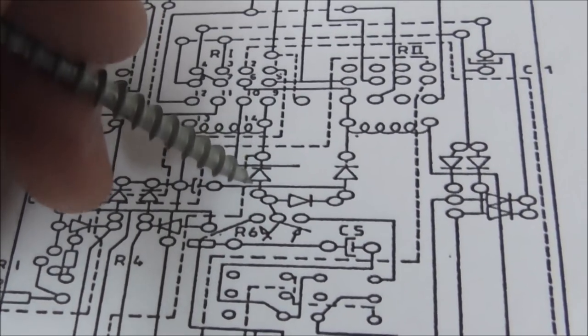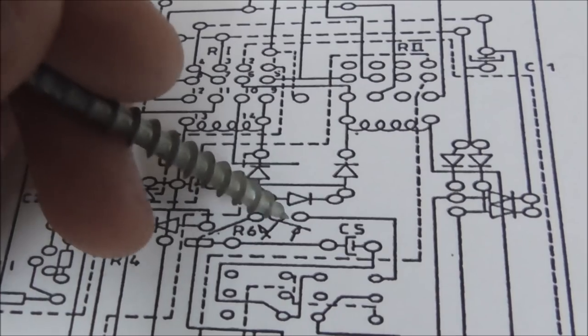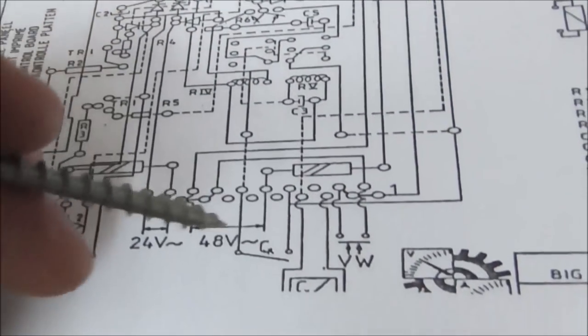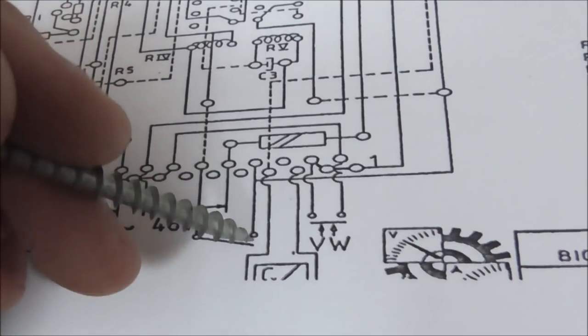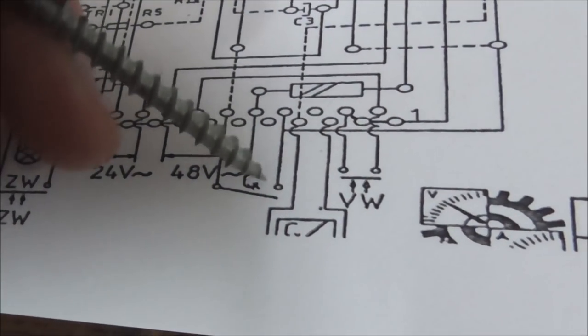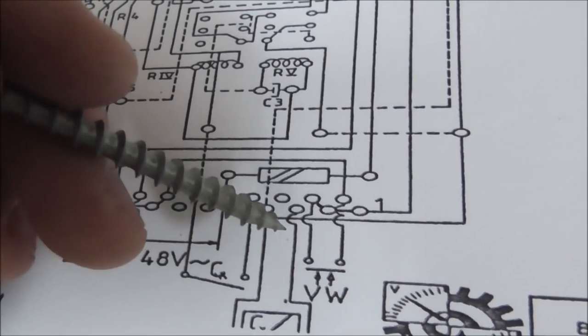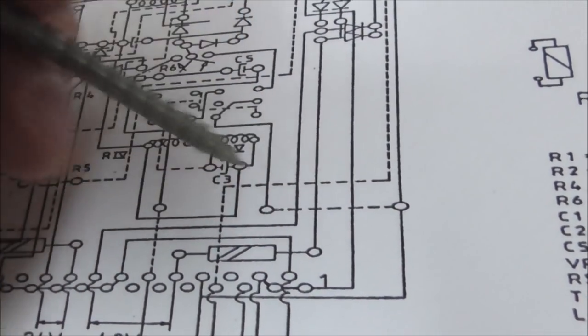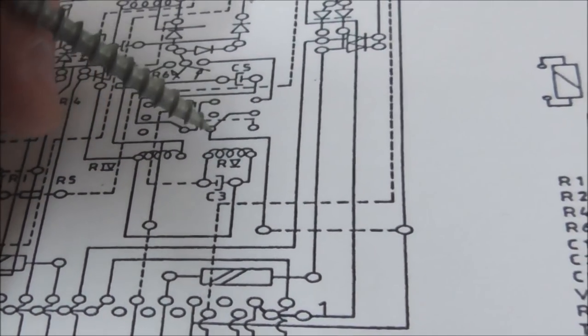Okay, so this is the diode that we just replaced, because I was saying, well, why won't the 24 volts just jump through? I don't get it. It's because the 24 volts isn't here, but that's how it's designed. So this one is just like our board. It does the same thing. You just saw where it goes around the edge of the board and it jumps over here. And just a second ago, I was saying, yeah, that's where it's getting its 24. Nope. Going to a relay.